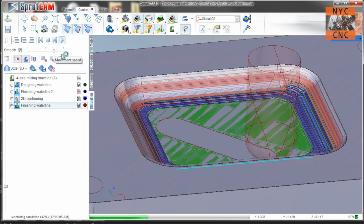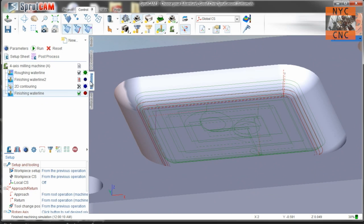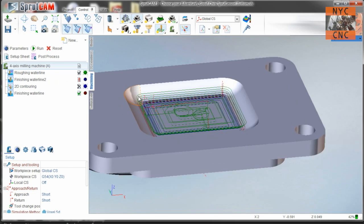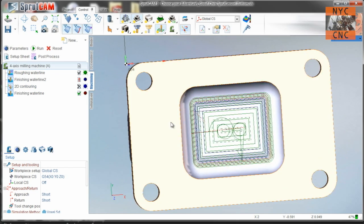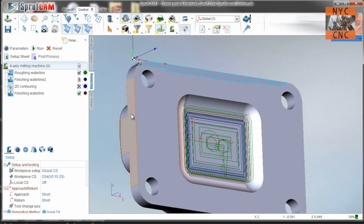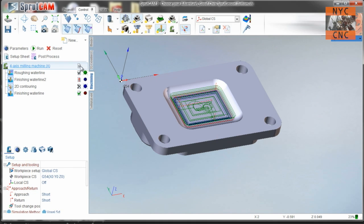In theory it won't be as perfect, but let's see if it's acceptable. You could make it significantly better by doing a much smaller scallop — it's a good workaround if you don't happen to have the right tool. With that, the last thing is confirming our Y zero and X zero are set, so we're good on that front. Let's head over to the Tormach and make some chips.